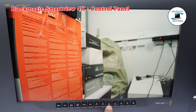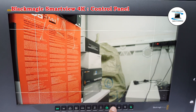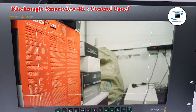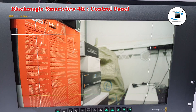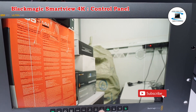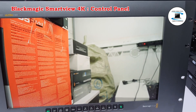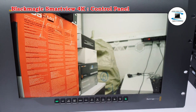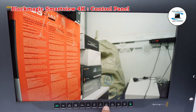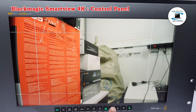To view horizontal and vertical frame markers, press the H-Mark and V-Mark buttons respectively. To edit the markers, press each respective button again to highlight each guide. This allows you to edit the markers' positions using the up and down arrow buttons. Subsequent presses of each button will confirm your new positions. Another press turns the markers off.